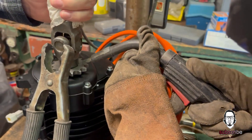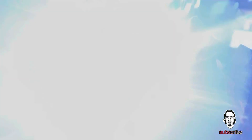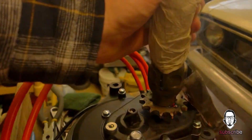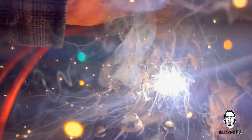Prior to placing the old motor adapter onto my chain sprocket and the gear drive on the motor, I placed metal shims within it and made sure it was completely centered on that metal sprocket that I'm now welding together. The reason I did that is because you want minimal wobble as it spins — I don't want any at all. So I made sure it was centered, held it in place, put some spot welds, then removed it from the motor and did a complete weld job.